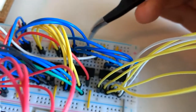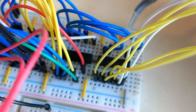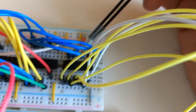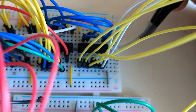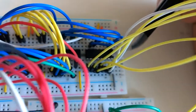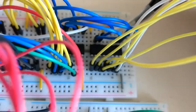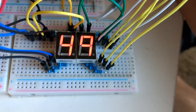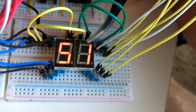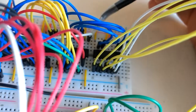It doesn't go all the way to 16 — it's four lines because it's a decade counter. The output lines go to a 74xx4511, which is a BCD to seven-segment display driver chip. It takes the four BCD input lines and turns that into the right pattern on the seven-segment display to show the number in decimal. The counter goes all the way up to 9 and then loops back to 0.